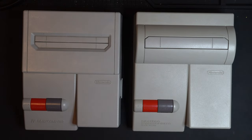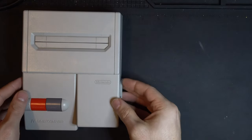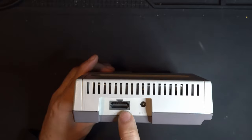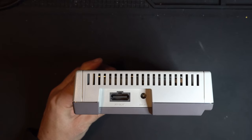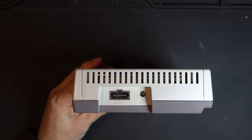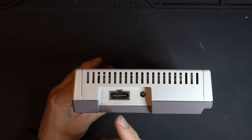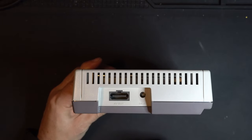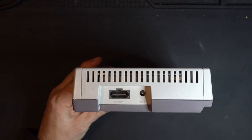Now, what makes the AV Famicom really unique is, unlike all of the other models of the NES, this has the multi-out, the AV multi-out, hence the name AV Famicom. So the multi-out was used on the Super Nintendo, the N64, all the way up to the GameCube. And because it has more pins, it's capable of transmitting composite video, S-Video, and RGB, that nice crispy RGB that we want for our upscalers like the RetroTINK, FrameMeister, the OSSC, or connecting directly to a PVM,